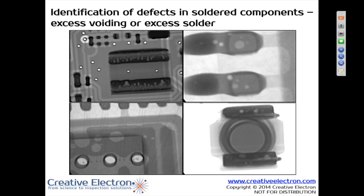Essentially in electronics, what we're doing is solder joint integrity — we're looking at voiding in solder joints. The majority of x-rays taken, even though we can do PCB printed circuit board multi-layer boards, we can look at vias, traces, and registration inside the printed circuit board. Typically all printed circuit board manufacturers, when they decide where they're going to drill the through holes, those locations are based on x-rays. You'll take multiple images, look at the multiple layers, and compromise so you don't break out of one of the vias inside the circuit board. But in most cases we're looking at solder joint integrity, or a lack of solder or an excess of solder in the solder joint.